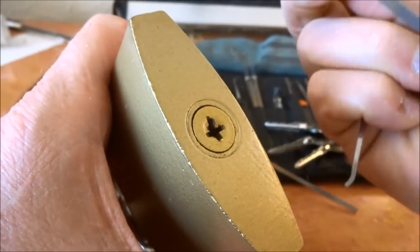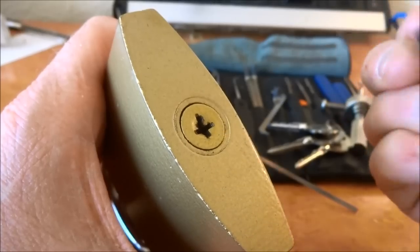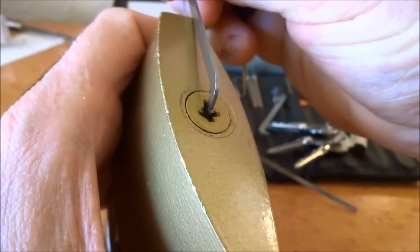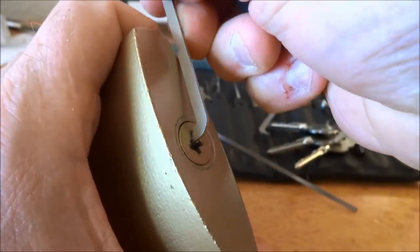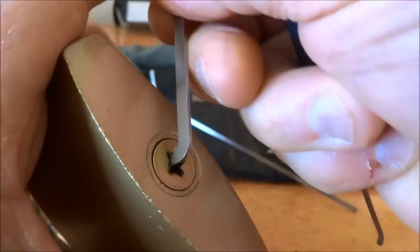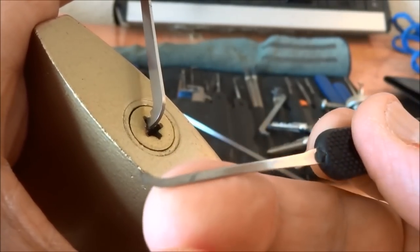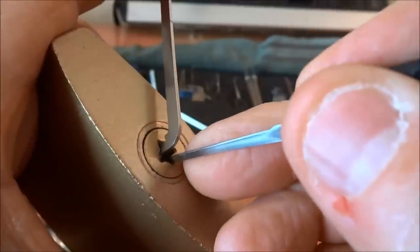Since I can't tension it on the top, I've got to go from the sides. I thought, well, it's a normal lock — I'm just going to take a Peterson pry bar, just like we do with all the other locks like Yales and such, and tension it right there from the top. We stick it in there and give it a little twist to overcome that very strong spring tension. I'm going to be using a nice fat pick — this 25-thousandths — because it's a really wide keyway and I can get away with it.